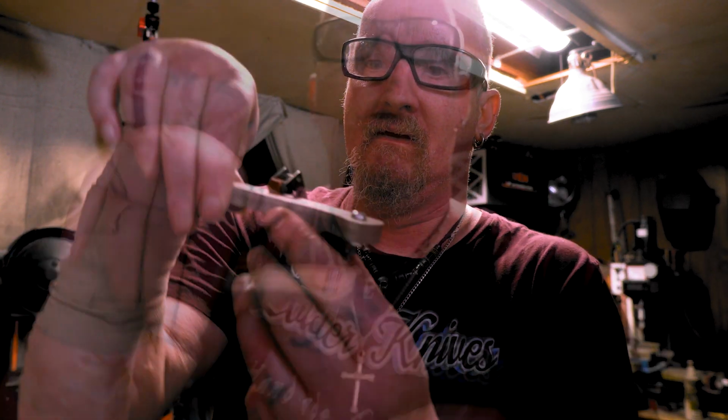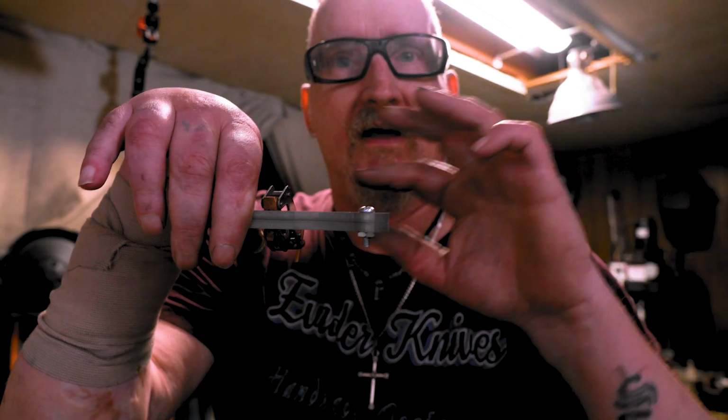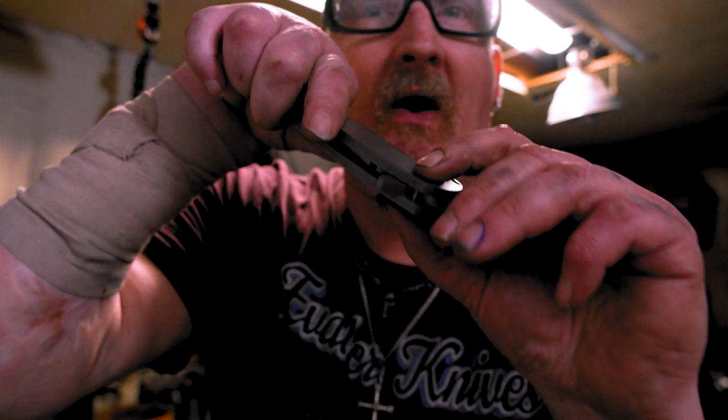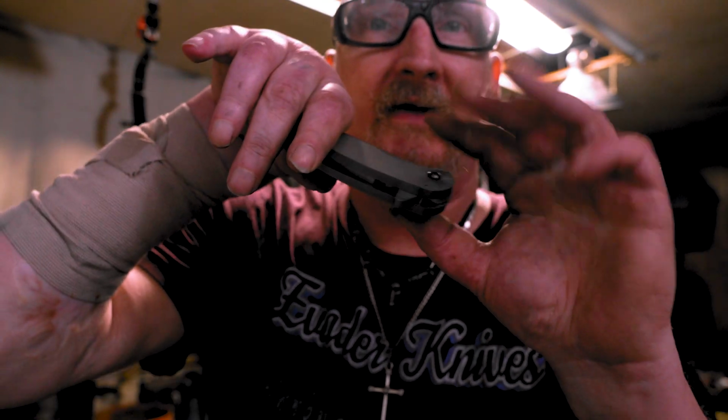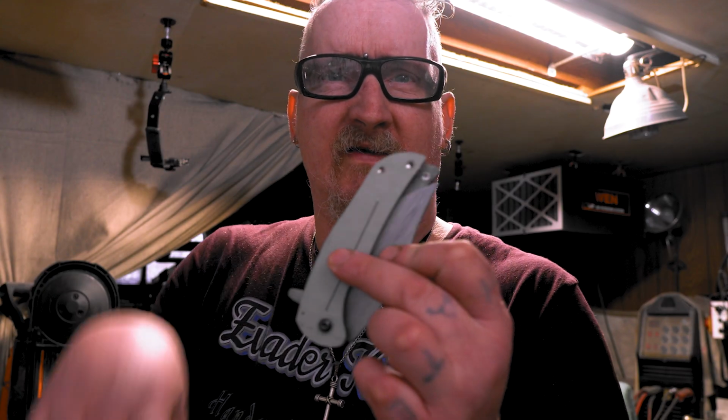I figured out a few steps. I'm going back to the Economize way of putting the little hole in right here, instead of trying to do the hidden holes and all that, because they always seem to be off. But what I did is I reamed this out to 3/16. Now I got a 3/16 clamped here. I got this all mounted flush, so what I'm going to do is take this bolt out, drill the 1/4 inch for here, and then do all the holes I need. I figured it out on this one. I did this hole, and then I took it apart and did these holes. They still lined up, but I figured out I'm going to do all my main drilling, that way I can just switch up bits, drill everything at once, and then take it apart and counterbore.